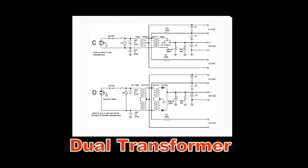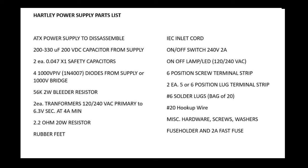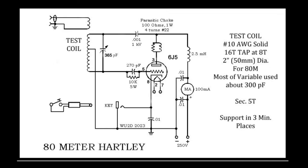Always remember, this is high voltage, so be careful and bring everything up with a variac if possible. In the next video, we're going to build and test the breadboard Hartley using a 6J5 valve just so we can get started with oscillations.